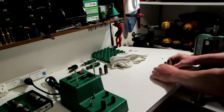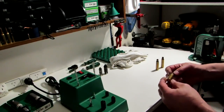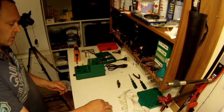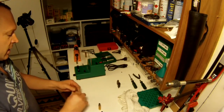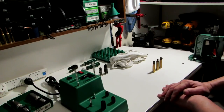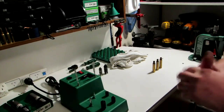Starting with fired rounds — these are my 338 Lapua. I'd normally get all the rounds out, sit them on the bench, do a basic visual inspection to make sure they're all fine. I'll check my primers, how everything was firing, what sort of pressures I'm running, making sure everything stayed consistent, and I'll also have a record of what the shots did. If they're basically fine with no dirt, I don't tumble or clean them at this stage. In the 338 Lapua, I really only run brass for around five to six firings, then they go into storage to be re-annealed or worked with later.